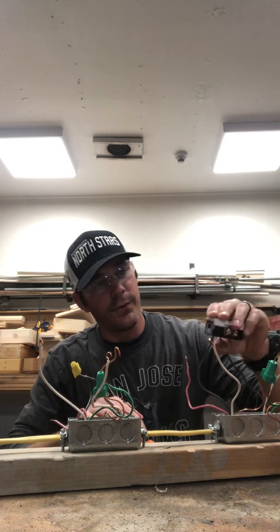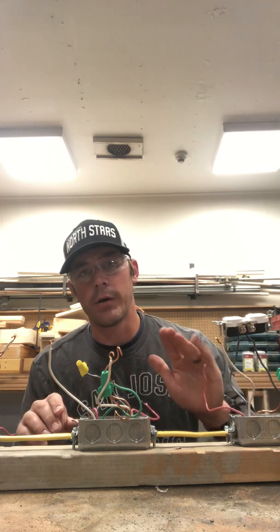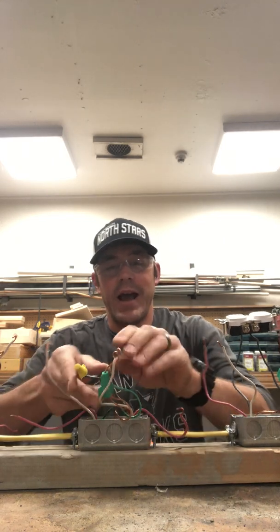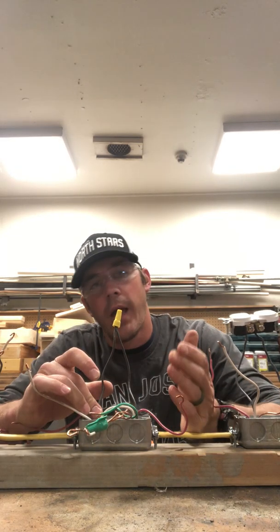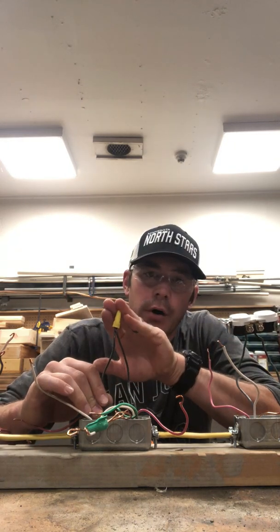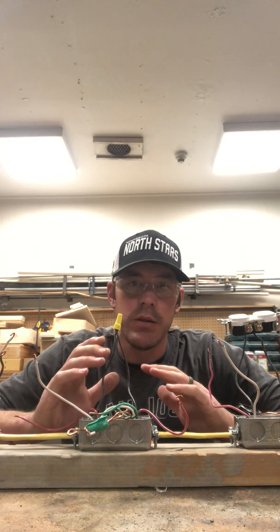Okay, the hot wires for our first appliance in box number 1, our duplex outlet, are connected. So from there, where's that power going to travel to? Well, we're not going to have that wire directly running to the lamp holder in box number 2. If we were to have that black wire screwed into the terminals on our lamp holder in box number 2, there would be no way of controlling that light. When that power gets to that lamp holder, that light would never turn off.